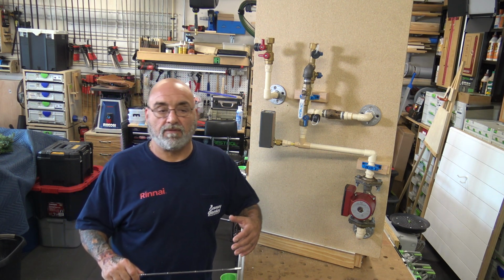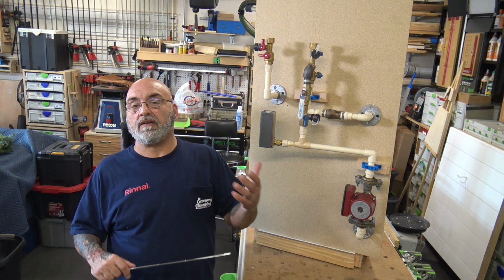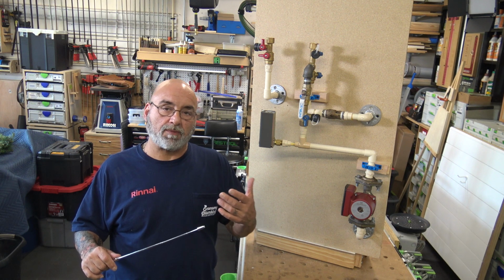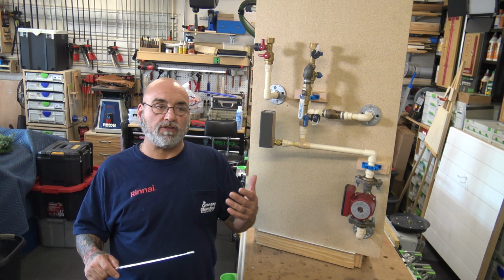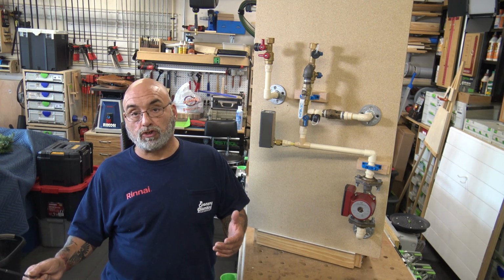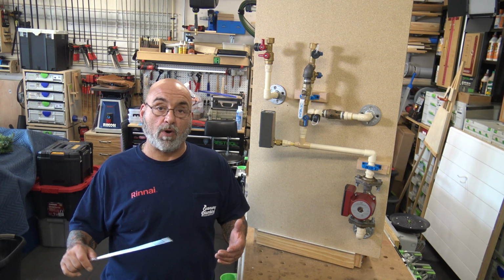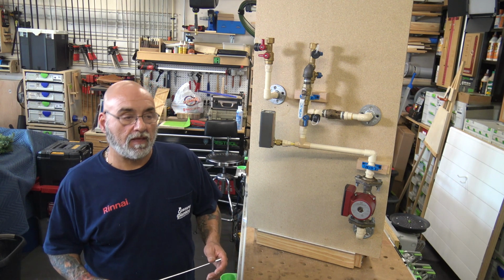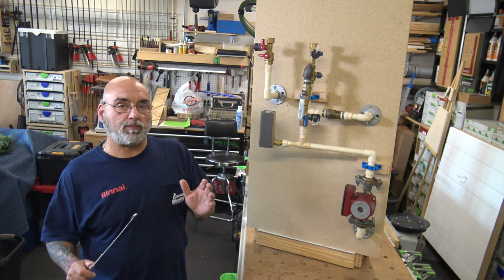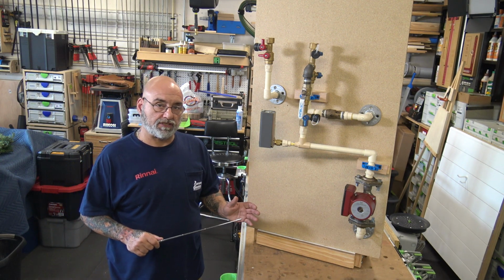Now, you could connect the pump to the tankless. You can follow the directions on going into the program, into the parameters, to do like you do with an RUR. You can have the dedicated or crossover long loop, short loop, economy mode, or comfort mode. But when you're doing it this way, you pretty much got a foolproof return system.